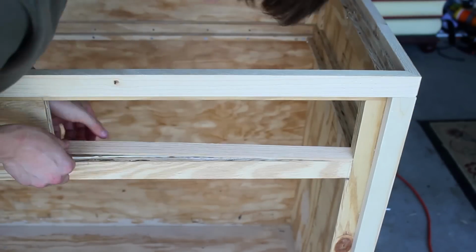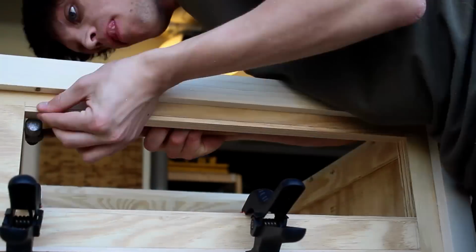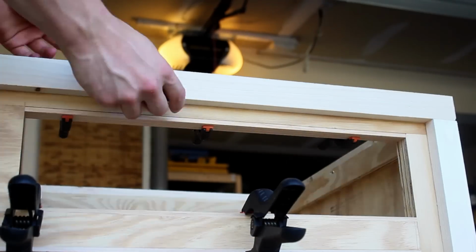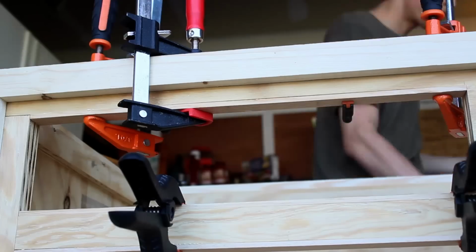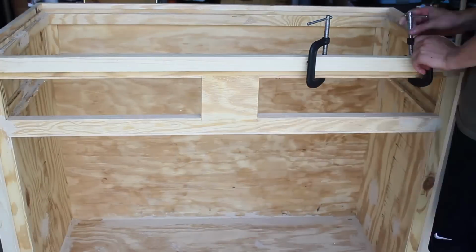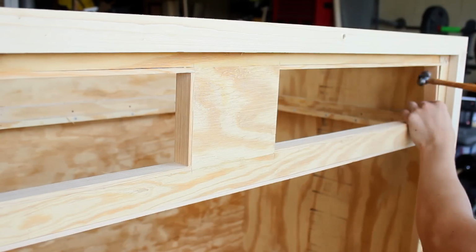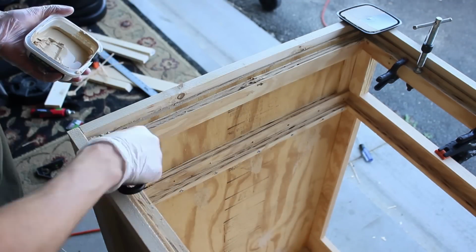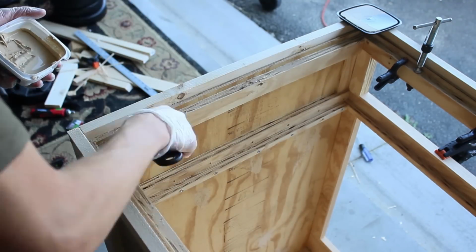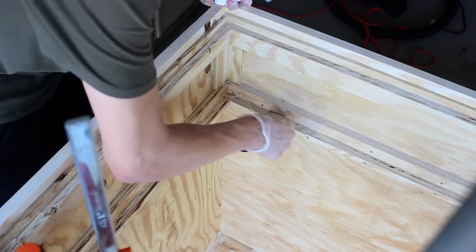Remember those thin pine slabs from earlier? Like the main opening, I used these boards to line the light compartment openings. Again, I did this to hide the unsightly layers of plywood and to create a more finished look. Finally, I got some wood filler and smeared it all over the seams between the plywood strips. I did this to create a smoother surface for the epoxy that will be added in just a bit.